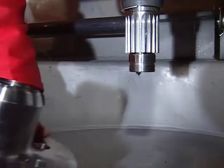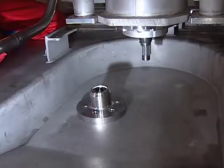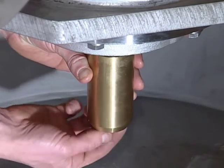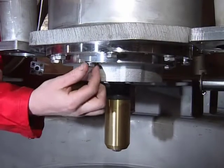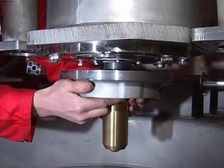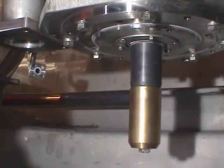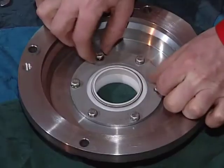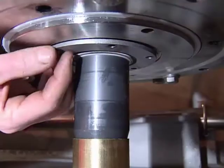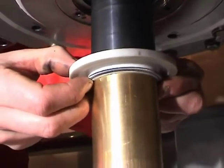Be very careful not to damage the o-rings and ceramic sleeve. Remove the ceramic sleeve retainer. Install the assembling cylinder to keep the ceramic sleeve in place and to protect sensitive lips on the lip seals. Pull down the seal ring housing with the cargo seal. The Teflon seal element must be removed and controlled. Dismantle the double cargo seal. Inspect the parts and change if necessary. The Framo single cargo seal must also be dismantled.